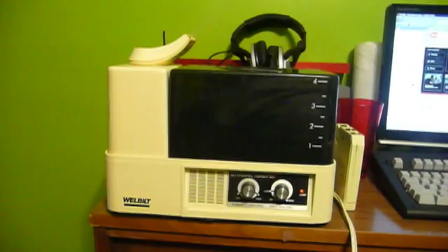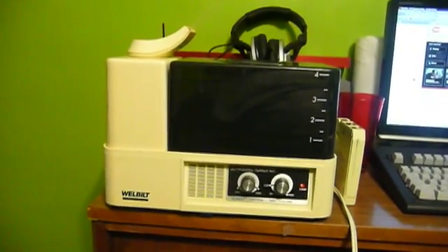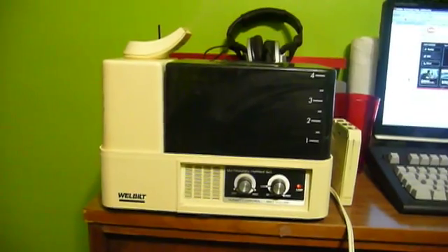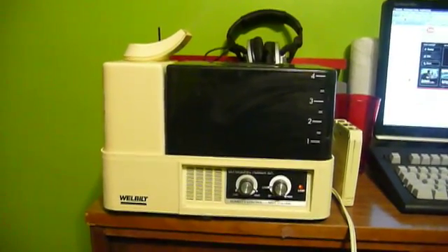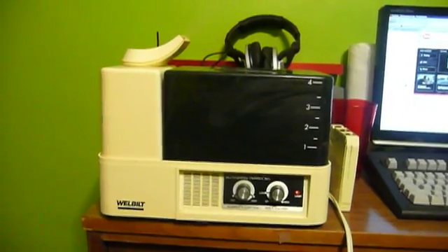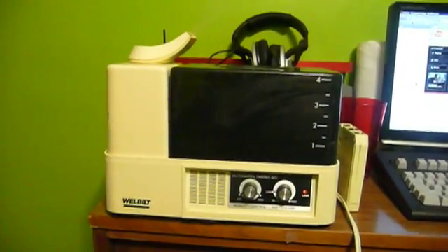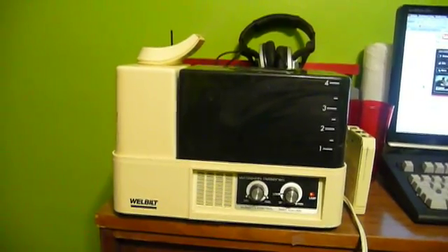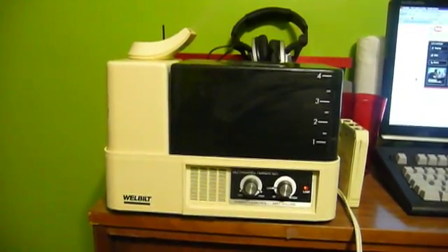Now many of you are probably very familiar with the common types of humidifiers, like the ones that might boil water into the air. You might even put a pot of water on your stove to do the same thing, or put a pot of water over a furnace duct or something. Other common types of humidifiers include the rotating drum type, where a drum covered in a foam-like material picks up water and has air forced over it by way of a fan.